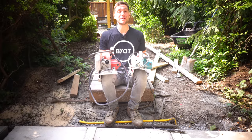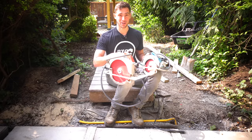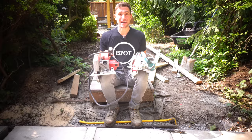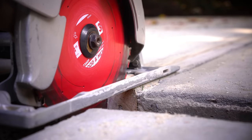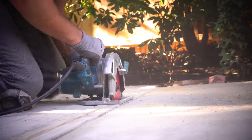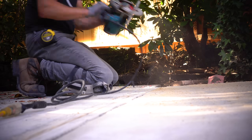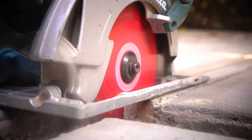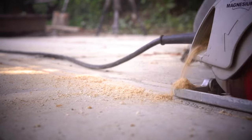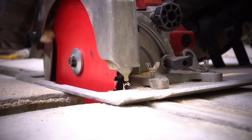The good news is that I was able to figure out a way to get myself out of this situation with a standard 7 and a quarter inch circular saw, but I also need a 10 and a quarter inch circular saw. The problem is not that the concrete is sticking to our 2x4s — the problem is that there's weight on both sides of our 2x4s pushing our boards together, meaning there's a significant squeeze point making it near impossible to remove. By running a blade down the center between these two boards we make a nice relief cut, and that small blade width is exactly what we need to release the pressure. I took approximately three to four passes with my 7 and a quarter inch blade so it could run more smoothly every single pass versus trying to do it all at once.